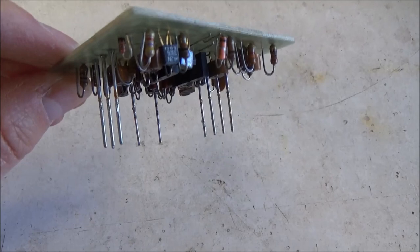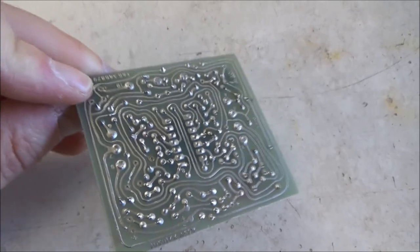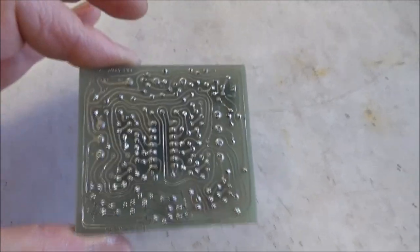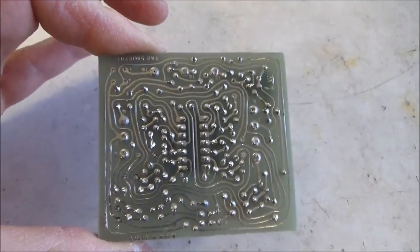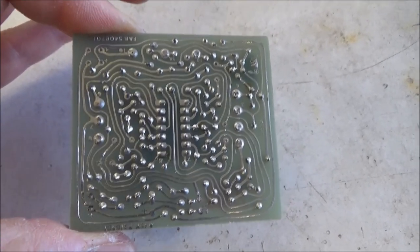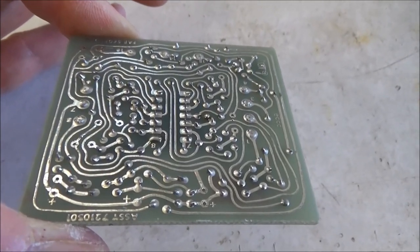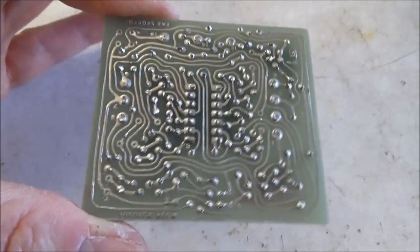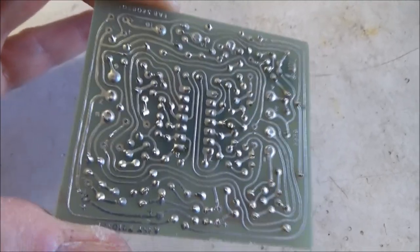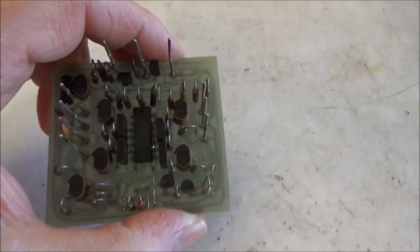Unless you're very, very adept with the soldering iron, particularly the desoldering portion of it, I would think twice about messing with this guy. The traces on the backside are not protected by any solder mask. They're very thin traces on a single-sided board. Usually when I work on one of these that someone has already been working on, I find the traces and pads lifted. So it's very easy to damage. So use as little heat as possible.